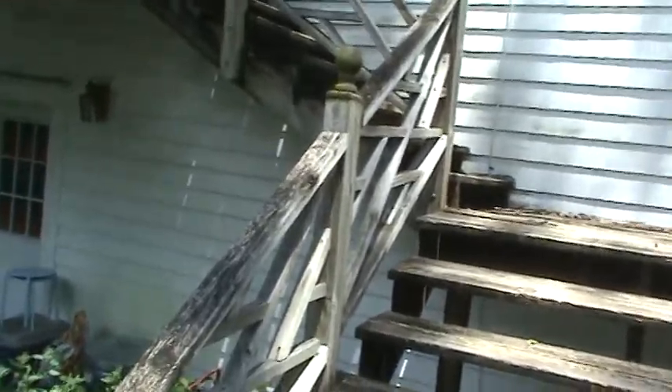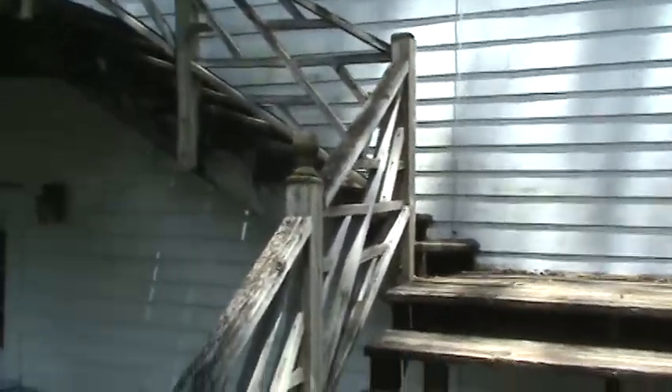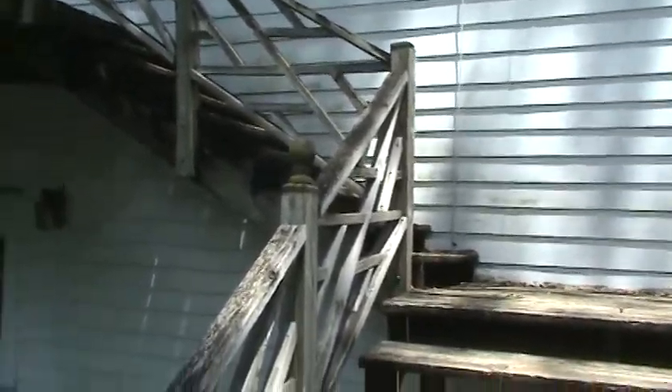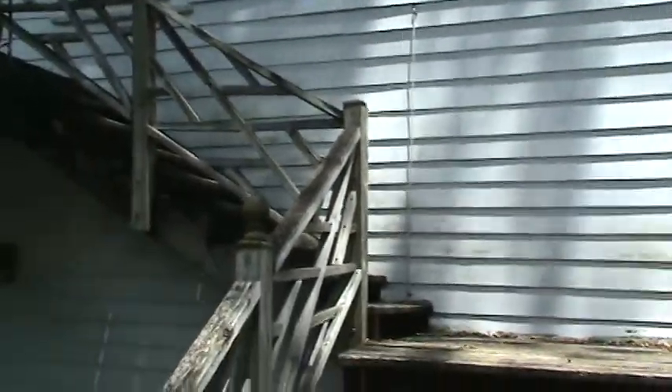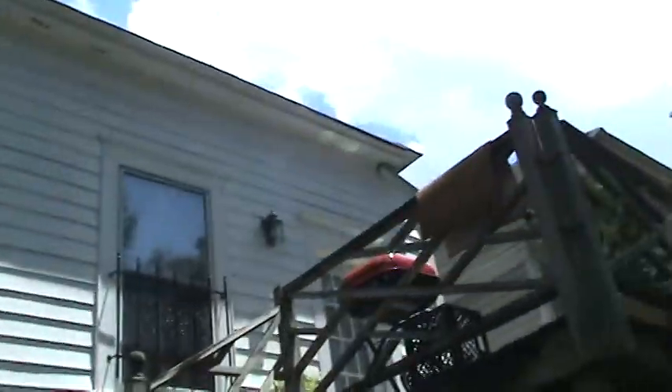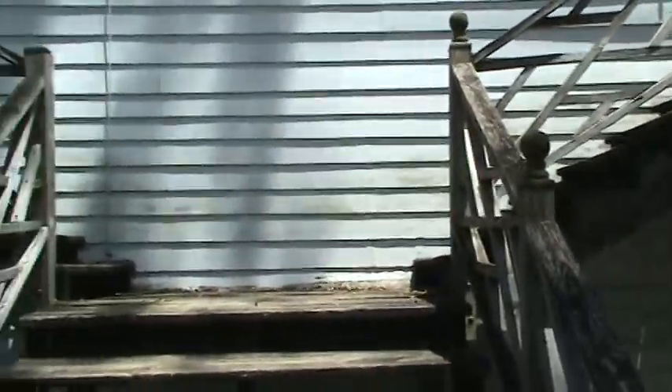On the railings, most of this stuff was nailed instead of screwed. We're gonna have to repair some of these two by two inserts. My carpenters will check through this stuff as we're coming through. All of the two by four top cap on the stairwell, on the stair railing, and then on the top railing around each one of these decks needs to be replaced. We're gonna go ahead and bid A and B so you'll have both of them. This is the B side.